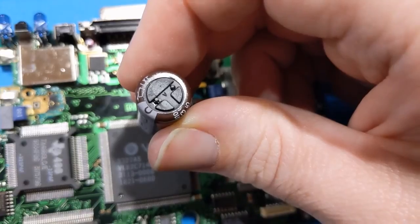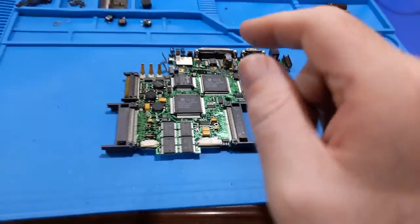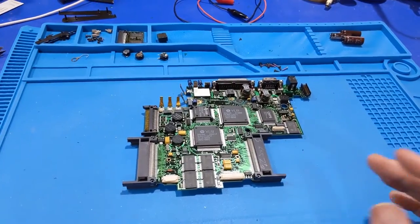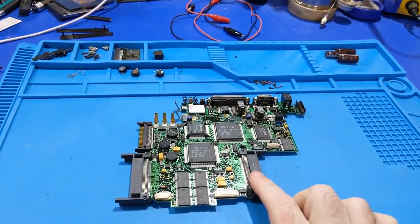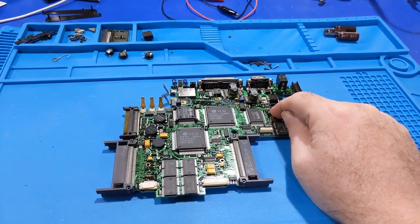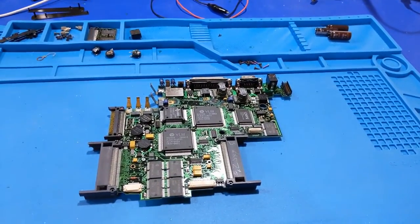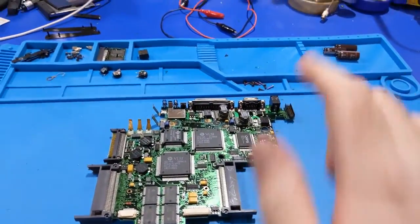They were on their way out. What prompted me to work on this is, about eight years ago I had this computer plugged in and it worked fine, and I put it away. When I brought it out today, when I noticed the vinegar syndrome developing, I just plugged it in to play with it. It didn't turn on, wouldn't turn on. I saw it drawing current from the power supply - keep in mind the center pin is negative on these HPs, not positive. It drew current but would not post - the screen would not turn on, the on button wouldn't do anything. One thing led to another, I took it apart, and that's when I discovered that the capacitors are leaking.